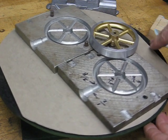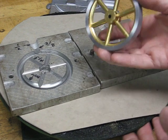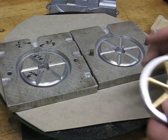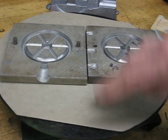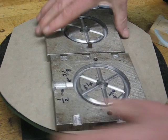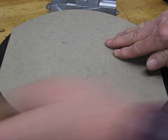This is the permanent mold that I use to produce the flywheel for this little Stirling engine. It's about three and a quarter inch in diameter and the permanent mold has simply been machined out of aluminum. You pour the flywheel just like you would weights for fishing. Works real good.